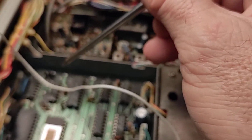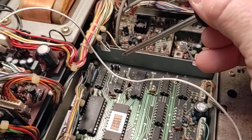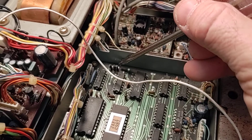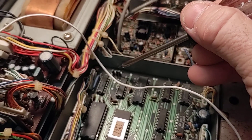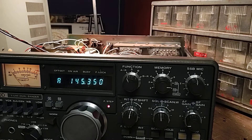The international instructions say that you end up moving the position of the ferrite bead. This jumper is actually back here. All you have to do is unsolder all three, re-solder them in the forward positions, and when you turn the radio on it comes up with the correct frequencies.